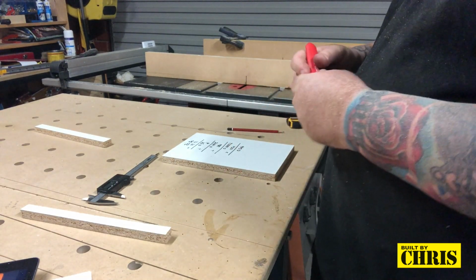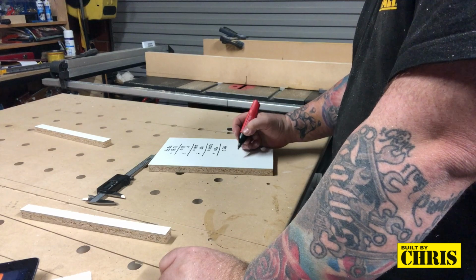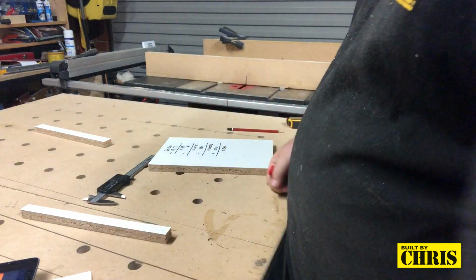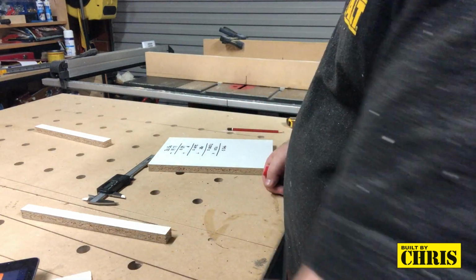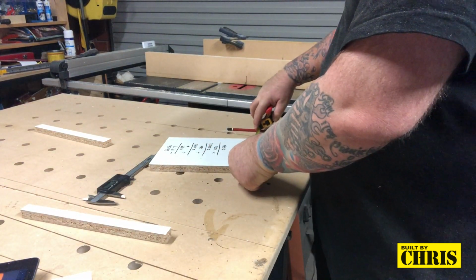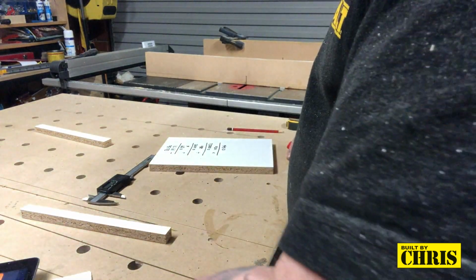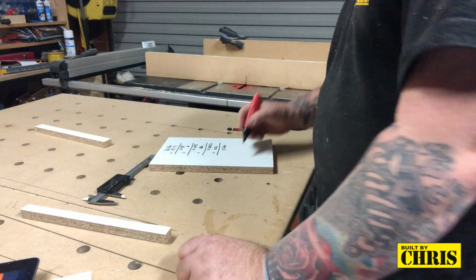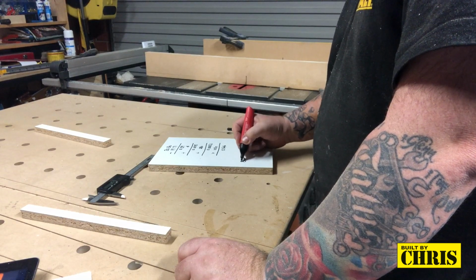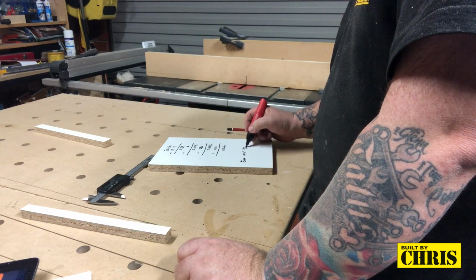Now what I'm told is that error is over the distance of all these cuts. So the distance of all these cuts was just on a metre, because you're looking at 280, let's add it up, shall we? I've got a calculator. 280 times 2 plus 180 times 2 equals 920. So that's a half a mil, 0.5 of a millimetre over 920 millimetres.